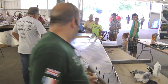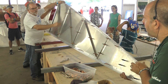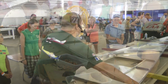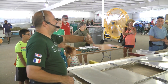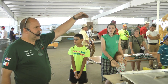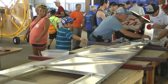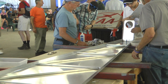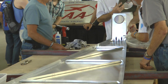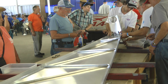Flip this over now — ready to join the sides up. Over we go. We need to remove those two big clecos on the inside. Just quickly pop those out. You can see it's picked up a lot of stability already. So what we're going to do is put into place the two horizontal tail bulkheads. These bulkheads help to stabilize the tail end of the fuselage, because back here is where you're going to get all the torsion and energy from the tail feathers — the elevator, the rudder. We need to make that back end stable, and it will give us something to clip to.